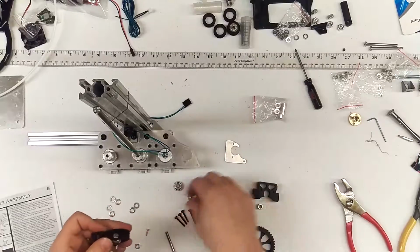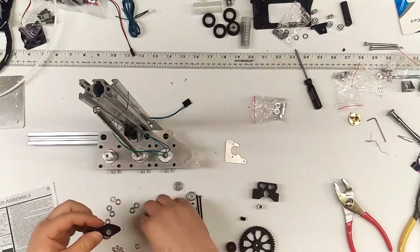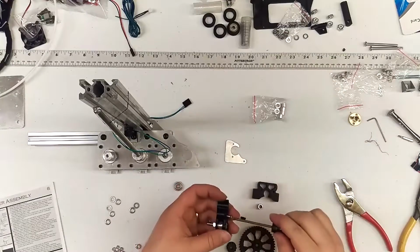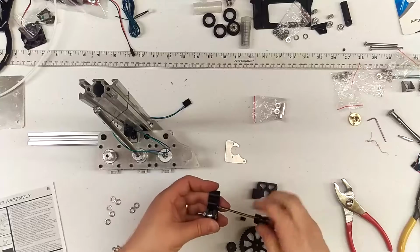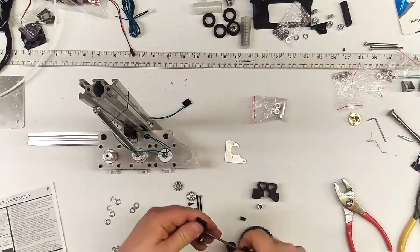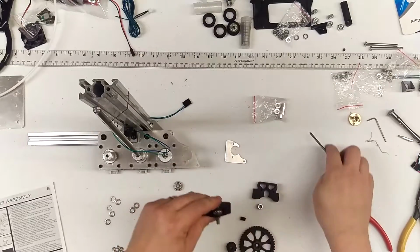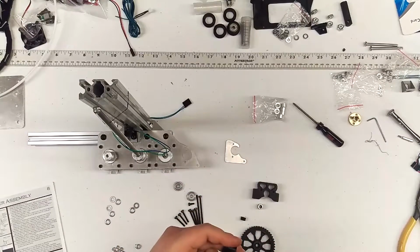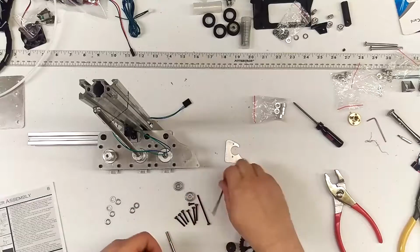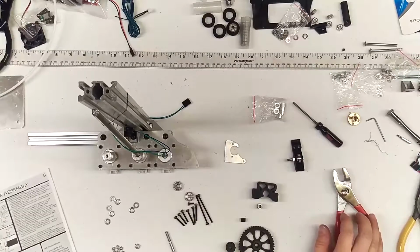Your next step, you may want to make sure that this hole is open. It should be fine. You shouldn't have to drill any of this out. Your next step is going to be this silver, or not silver, but that wood screw, number 4, 1/4 inch wood screw. Send it on into this side over here. I believe it has to be pretty flush. You definitely want to make sure it's seated in there well. Make sure everything's good and snug. And this guy should still run through. Alright, so this is your tensioner arm. We're just going to set that aside for a minute.